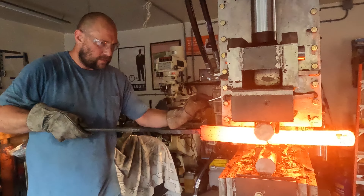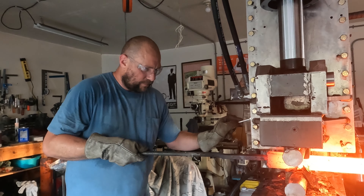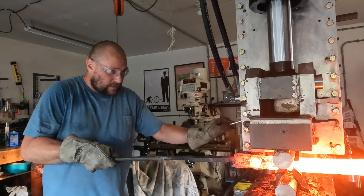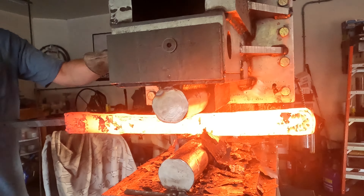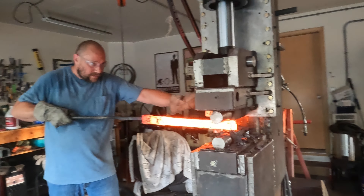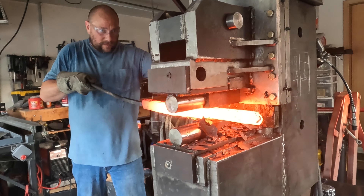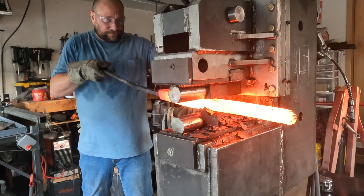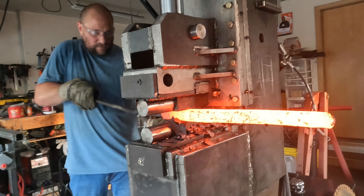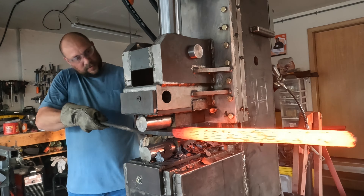You can see the temps now. I have my temperature set a little higher now that the bar is forged and homogeneous, so I'm getting a little more aggressive with the pressure to draw these out. I'm still looking to have my first three or four heats on drawing the bar out at around 2200 to 2300 degrees. You can see I'm turning it sideways now and hitting it on the corners — this produces a different pattern in the steel.